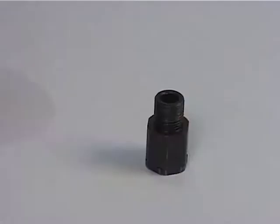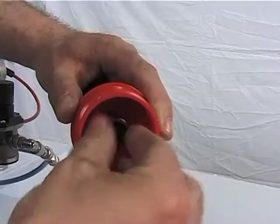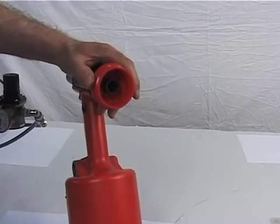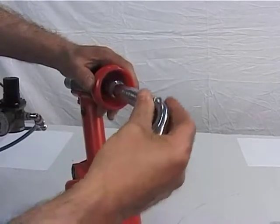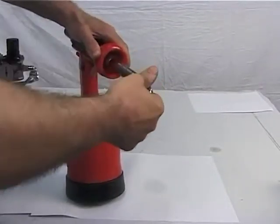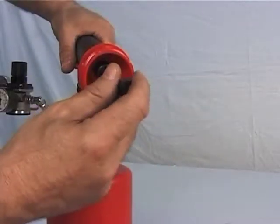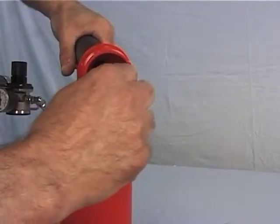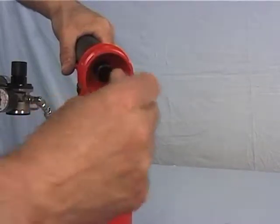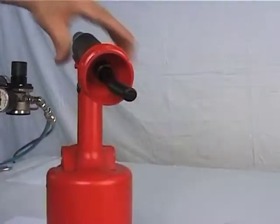Mount the container connector, figure 28, and the output connector, figure 29. Fasten the latter by means of a 19 mm wrench. Insert the nails baffle, figure 32, and slightly press it until it clicks. This signals that the insertion has been correctly performed.